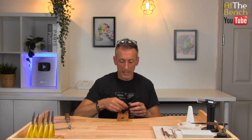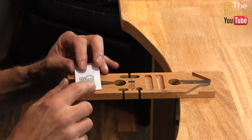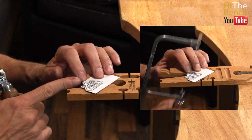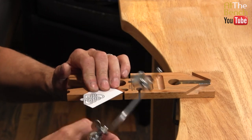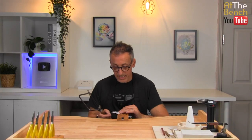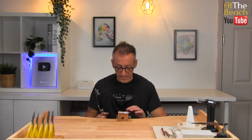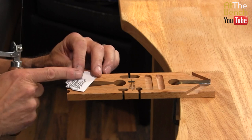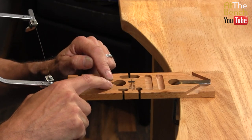I've got a piece of copper and I'm going to do a little bit of piercing. You can see I've got a design that I'm going to be cutting out. Because we've got this V here, the metal is supported on both sides. If I'm going to be cutting along this line, the metal is supported on this side and this side. If piercing on the outside, this edge would be flapping up and down, unsupported — and if the metal moves up and down there's a likelihood we'll break saw blades, which is not good. The smaller the piece you're piercing, the closer to the centre you'll move the metal. Smaller pieces need to be suspended and held on either side.